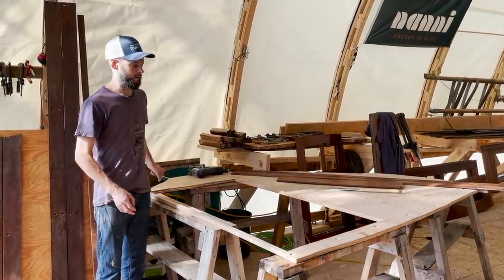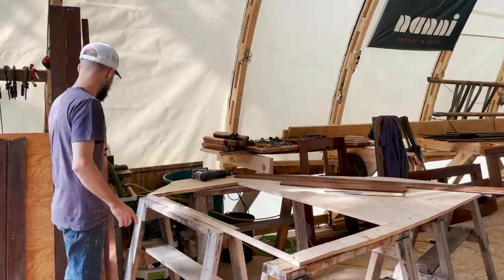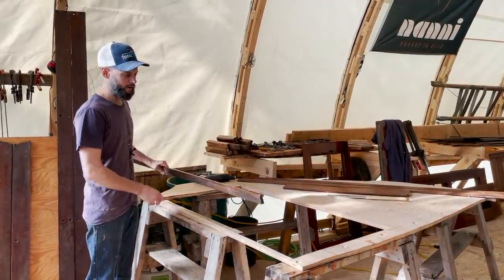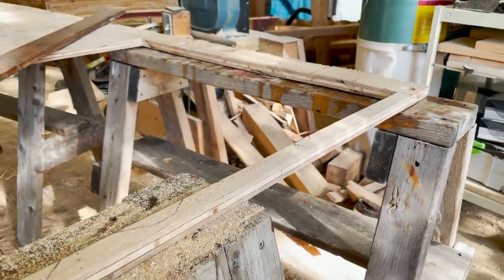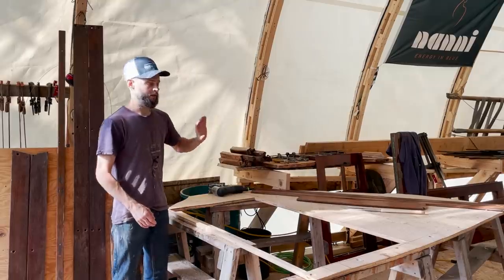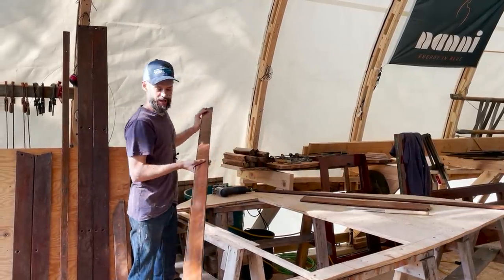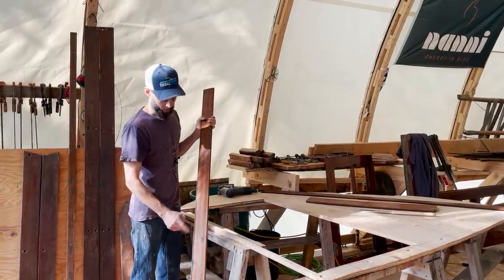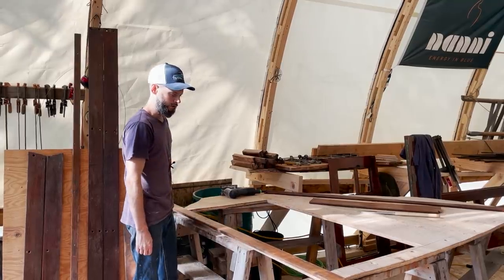And the first task is going to be to frame in the door to the forepeak. So I have some half-inch thick trim pieces, and we're going to rip these up. And they go inside to cover up where you see the glue lines with the cedar and the oak. And then on the aft-facing side, the side that goes towards the saloon, we're gonna put on these wide half-inch strips, which are perfect. One half is rounded, one is square with the cove. So we'll clean these up a little bit, and those will go perfectly.